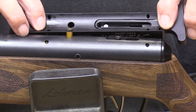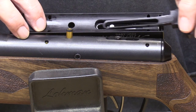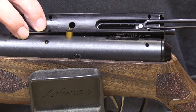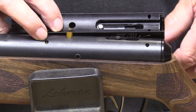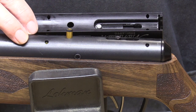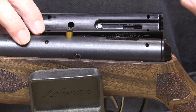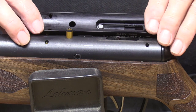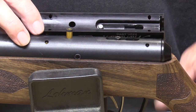When you first cock it, you're using this charging handle here, pulling back the bolt by that stud. That stud pulls back the stud on the hammer into the cocked position. And then when you let go, this slams forward. From then on the semi-auto mechanism kicks in, and you've got all the different springs. The timing allows for the semi-auto action to work off of the hammer bounce — that's how I understand it anyway.